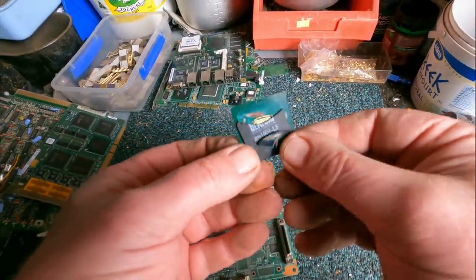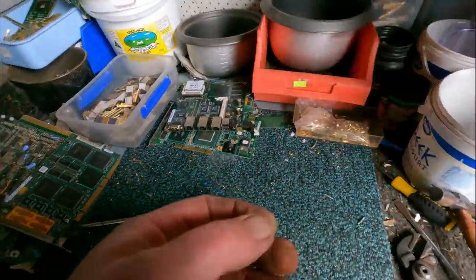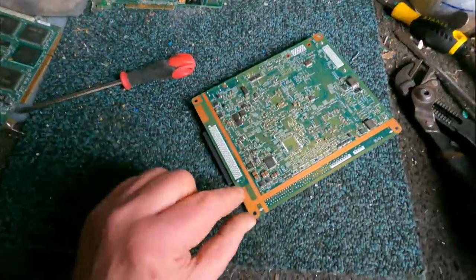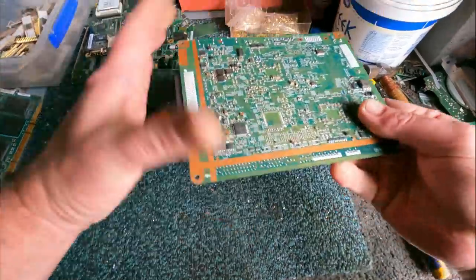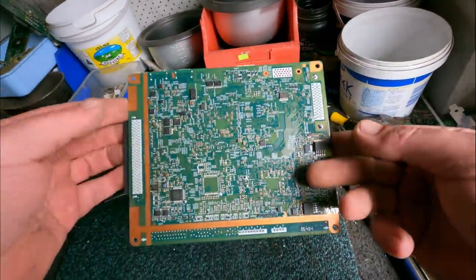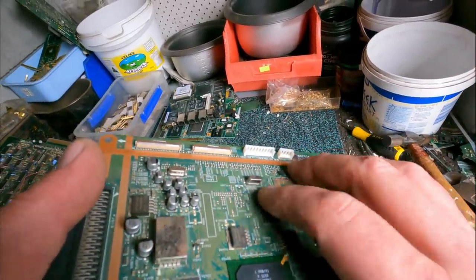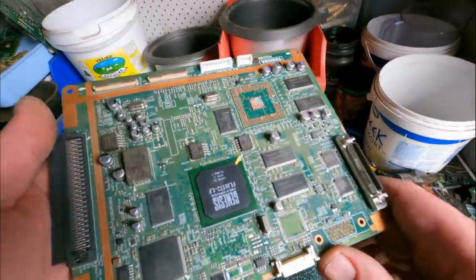Generally, removing MLCCs doesn't really devalue a board much at all. On a mid grade board I don't bother taking crystals off - they're only silver recovery, and usually I take them off just on low grade boards. But these ones are quite high, so I can get one. See how they're nice and tall - I always remove the little pin on the back and the little plastic bit. I like my crystals to be clean and ready to go. We've still got a good quality mid grade board.